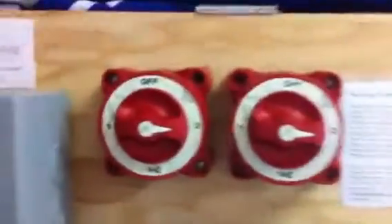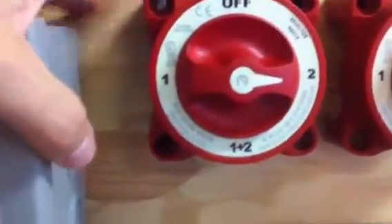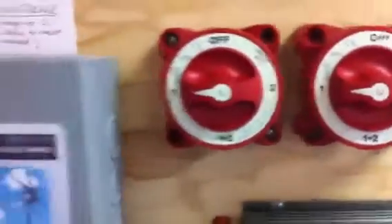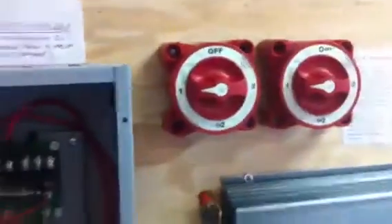I also have rigged up this transfer switch for the wind. I'll have a video to show how to install this. If I go into position one — which I'm going to do now — it sends it to the battery. I'll do the same with the solar, because I need to charge my batteries anyway. What this does with the wind is it will first charge my batteries, and when the batteries are completely charged it will take that excess load and through this relay divert it back into my plug-in grid-tie inverter.